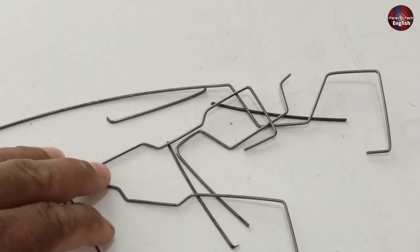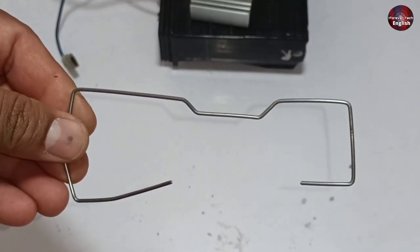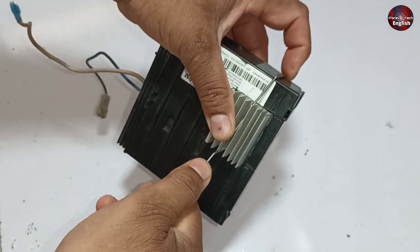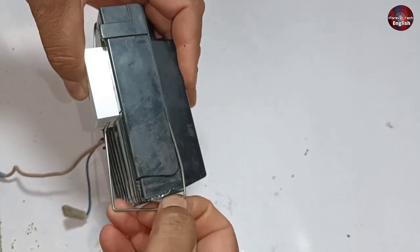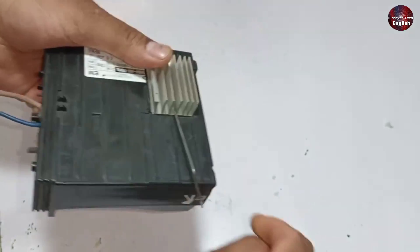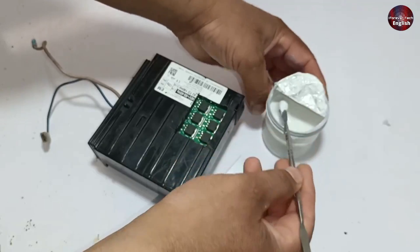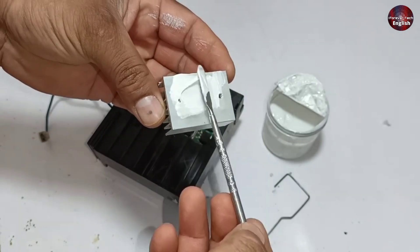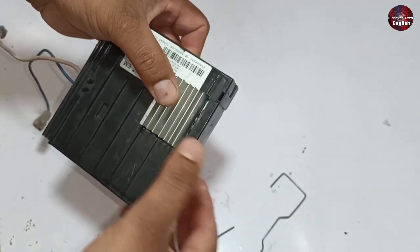To make these IGBTs cool down, I did a lot of hard work. Most of the shapes were not correct so I kept making them, and finally I made the perfect shape for my use. The heat sink is loose right now, so I will put the clip I made on the heat sink and box. The heat sink is not moving now. I will put thermal paste on the heat sink so that all the heat from the IGBTs could transfer to the heat sink. I will install the heat sink back on top of the IGBTs and install the clip to tighten it.